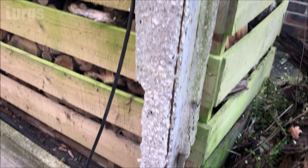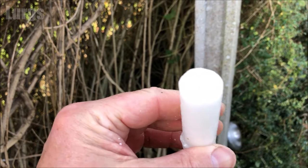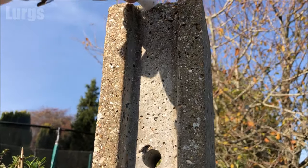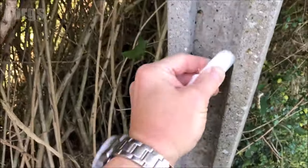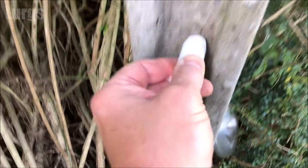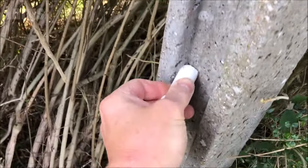I'll show you later how to secure the fence panels to a crumbling concrete post. Here's a top tip to make the fence panels go in nice and smooth: just take an old candle and rub it into the groove — at the back and on the sides. When you're lowering the fence panel into position, it just makes it slide down really easily and won't get caught on any divots. Just makes it nice and smooth. Do that on every single concrete post in the grooves.